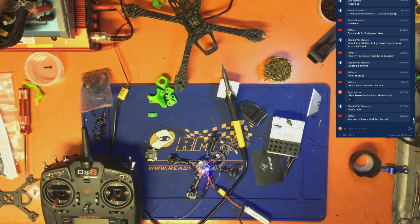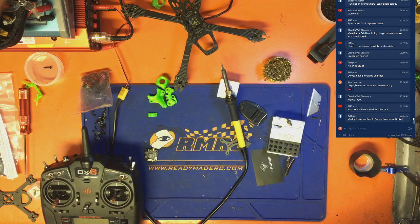Okay, so I heard no ESC chimes. So that's a bad thing. Everything is plugged in properly. So that means we don't have communication with the flight controller. Although the flight controller is lighting up, something is awry. Might have to rob parts off of that one. Okay. The stack is seated nicely, other than that right there. Hey, but the benefit of all of that is that we did not see a big poof of smoke.